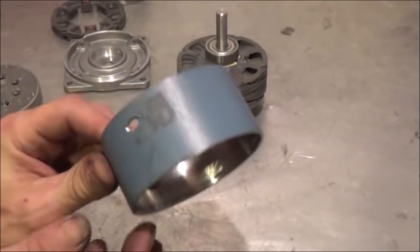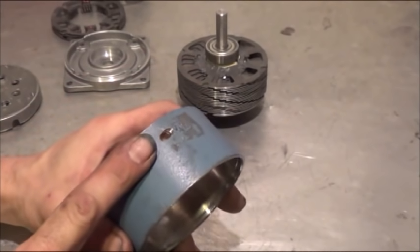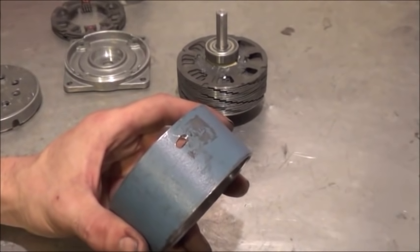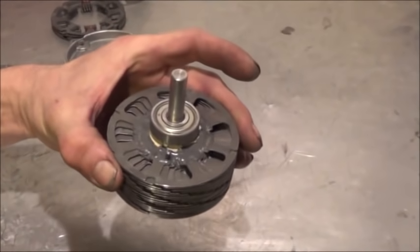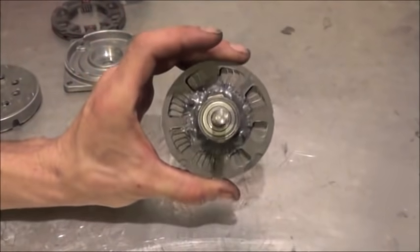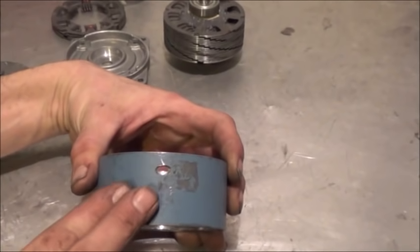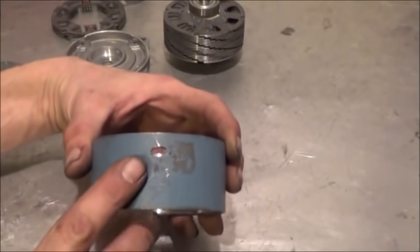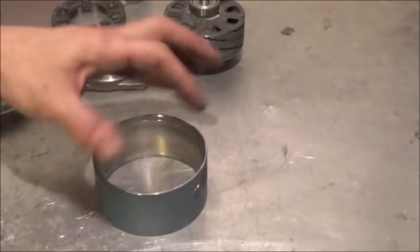The outer ring here, I've just got one little hole drilled in it. I've got it dual-slope, so I've pivoted it in two different directions — that way I could test both directions for which one would actually follow the cyclone better. There's an obvious path that physics says you want to spin it this way, but there could actually be a benefit to spinning in the opposite direction. You never know that until you try it, so I always leave myself an ability to test things like that. Once we're done with this, we can permanently attach the air input — or water input or steam input — channel onto this that would hold your hose, and that would be finalized.